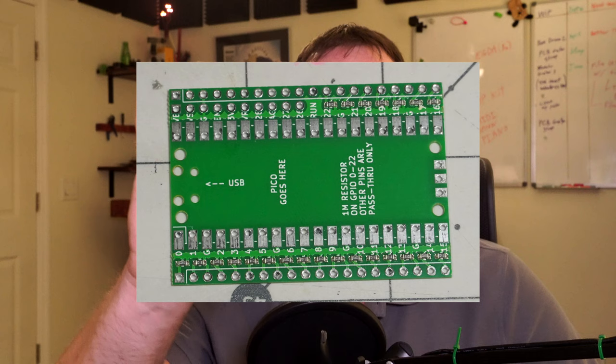You can use GPIO pins as capacitive touch inputs, but this requires adding one mega ohm or so resistors to each pin that you use. While it's a cheap upgrade, it takes time, volume, and possible frustration. My solution: a custom capacitive helper board called the Pico Touch 2.